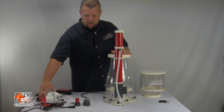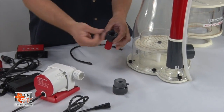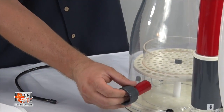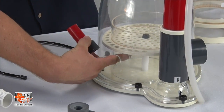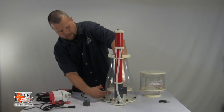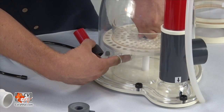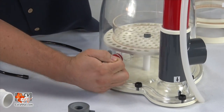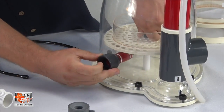To install the RODC pump, we are going to grab the output adapter. Make sure that the seal is inserted inside the nut of the adapter. Simply slide it into the hole within the side of the skimmer body. Notice that there's also an alignment hole on the inside of the bubble plate. If it is not aligned, just loosen up the screw, which will rotate the whole assembly to align it. Insert the nipple through, and if you need to align it, retighten up the bubble plate screw.